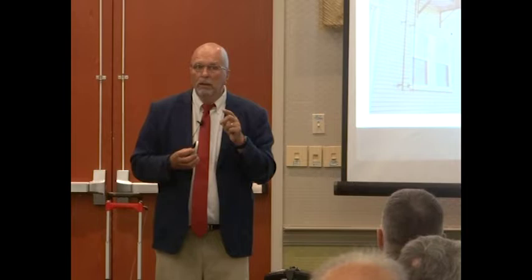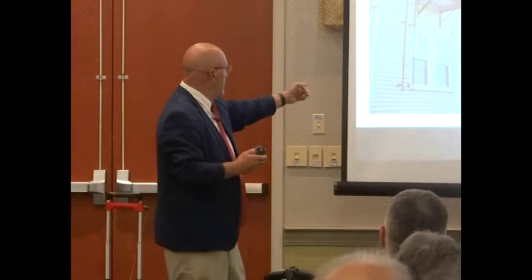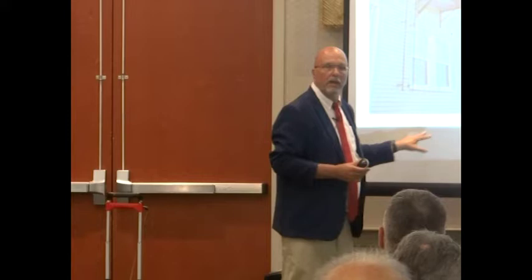Right now they do here. What code or what law states that that ladder at one time had to go to grade? I don't have it right now, but I remember reading it. It says that the whole system can be built, it's one of the older code books I was thinking of, and then at 9 feet, you have the choice to have an alternative to the ground. And the alternative was a sliding ladder. So a lot of these fire escape ladders have a ladder that sits right on it, and as soon as you release it, it slides right down and hits the ground. That's a slider.